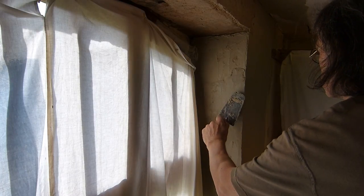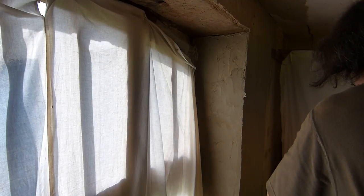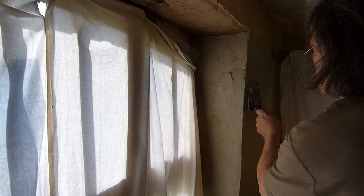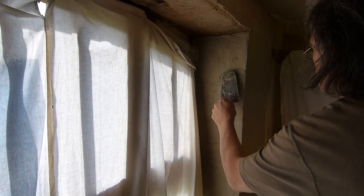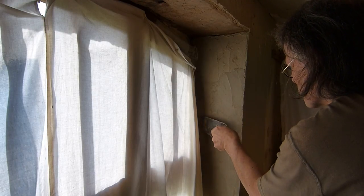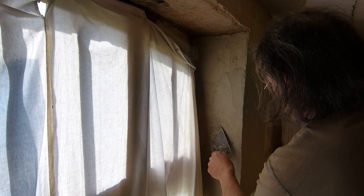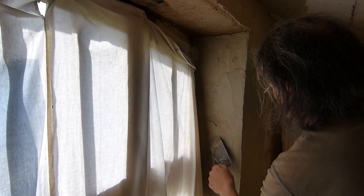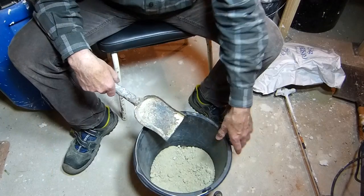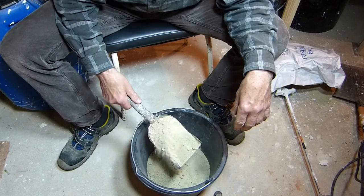Here, the technique of compacting the plaster into the wall is being used to apply plaster to recently laid brickwork. And in another break from convention, the undercoat of plaster was applied just 2 days after the brickwork was finished. In this way, the plaster is applied to the mortar before the mortar has completely dried and had time to form a sinter layer.